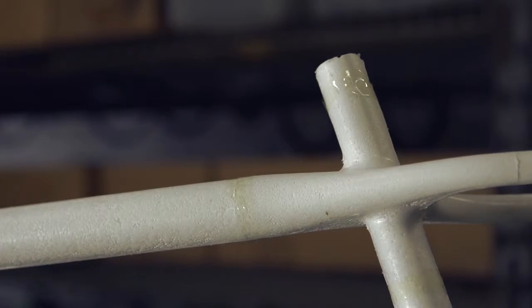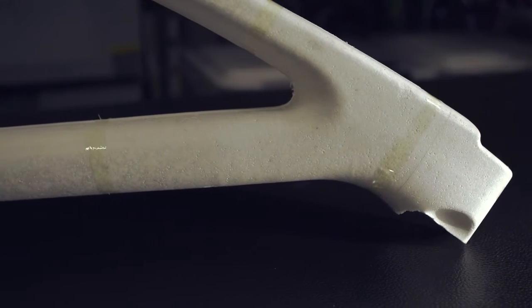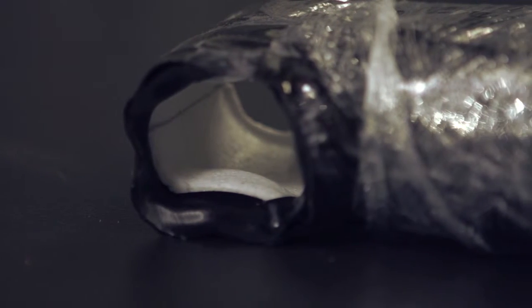Now, with our inside-out molding technology, we no longer use air pressure in an air bladder. We use a very specifically molded polyurethane or expanded polystyrene mold. Those molds are exactly shaped to the net internal shape of the bicycle frame. Everything from the front derailleur mount, bottom bracket cable guides, everything is molded internally as well as an external mold. So there's no chance for any waste, for any material to get wrinkled, or any excess resin to build up.